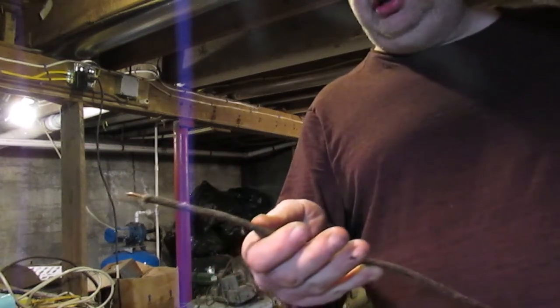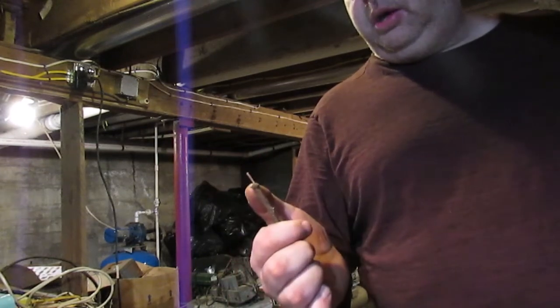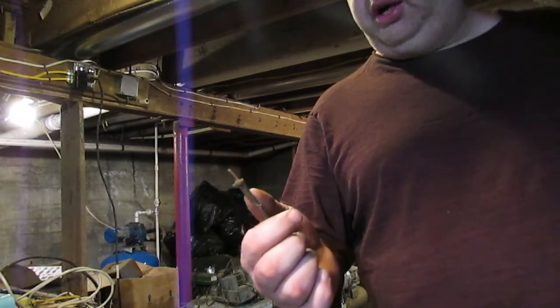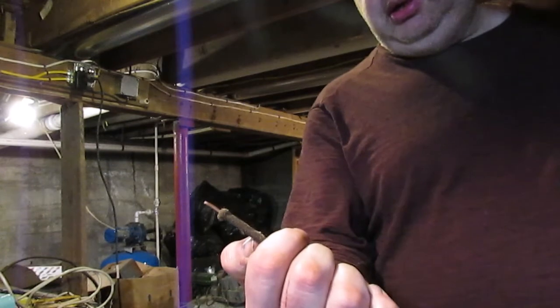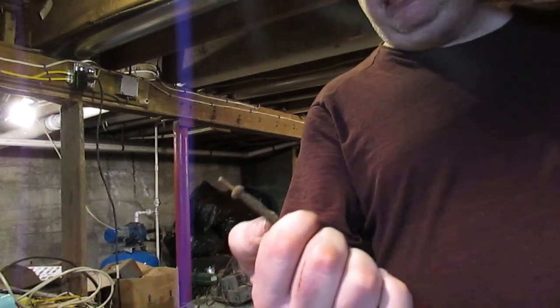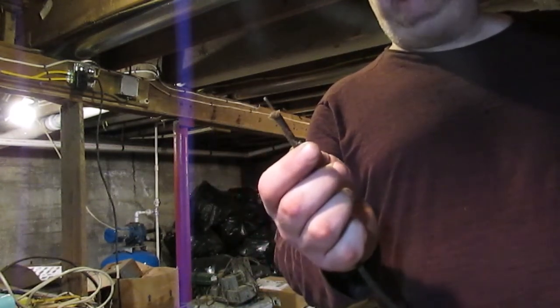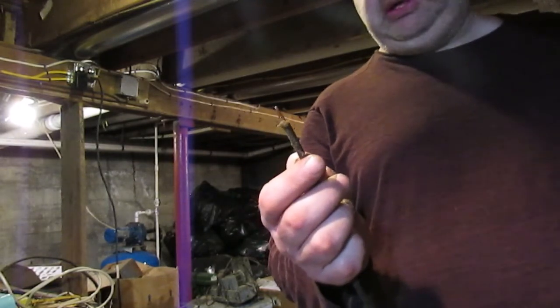This was some of the original knob and tube wiring. Individual conductor. This is rubber cloth impregnated wire, and as you can see, that is a number 10 copper strand. That's a solid strand wire. Now, there's nothing inherently wrong with this wire. It was okay, I mean, other than the fact that it was an ungrounded system.